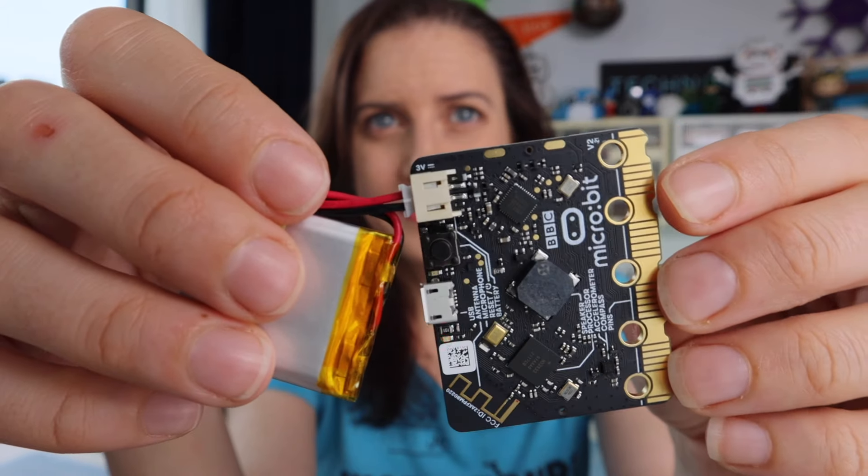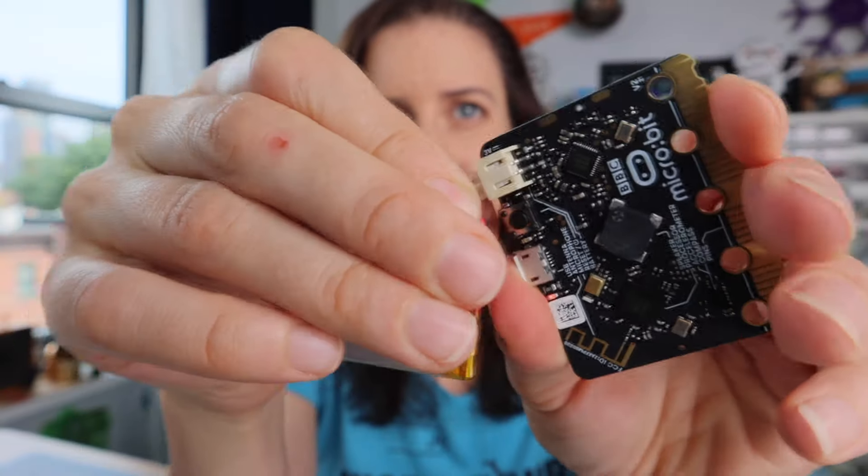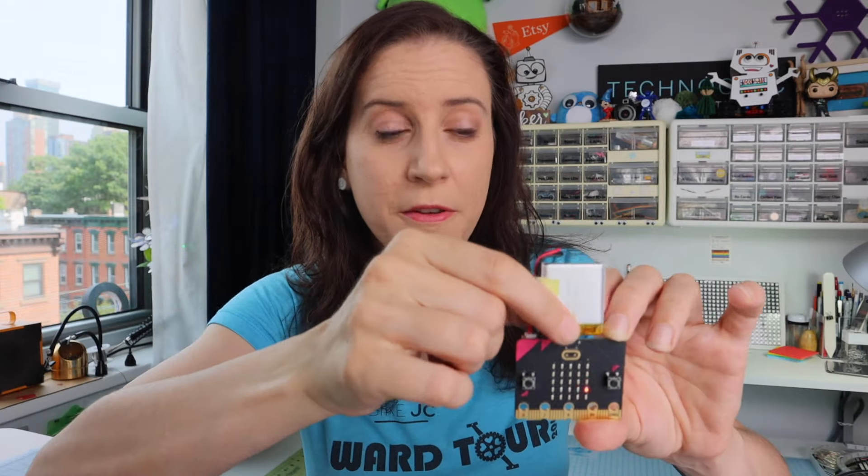This battery can actually give a little over four volts when fully charged, but the microbit wants only three volts. So is this incorrect? Yes, it is incorrect, but I've been using it this way for several years and haven't found any trouble with it when tinkering with electronics. I like to think the price of being wrong is the price of the microcontroller, safety things aside. If you find this troublesome, let us know in the comments and be descriptive about your exact situation so we can all learn.